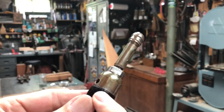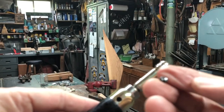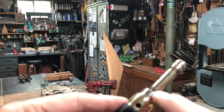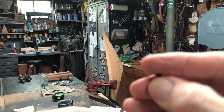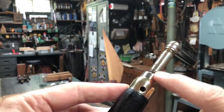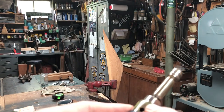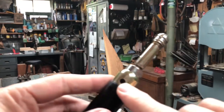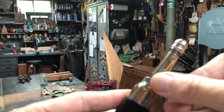Let me show you a close-up of this action. This is where I removed the screw — and it's important that the screw comes out first before you put a wrench to this part and unscrew it. The reason is there's a hole inside the threaded piece that this screw has to align with. It's very small and won't go in without proper alignment. When putting it back together, you have to make sure this is snug and the hole in the side of the threaded area is in alignment with this hole.